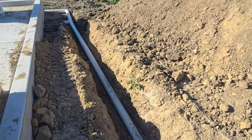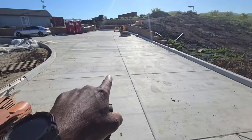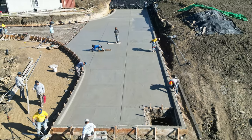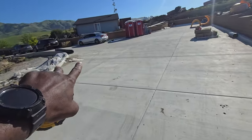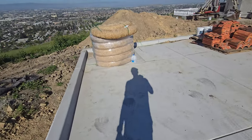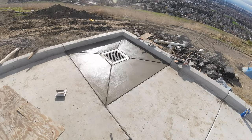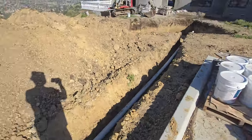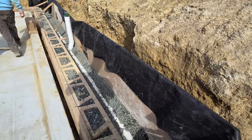These are all SDR 35s. There's a catch basin here — remember the 100-yard pour we did? I'll leave a link below; it's about five or six parts. Pretty much all the water from the back of that wall comes this way and feeds into this catch basin, overflows, comes out, and goes to the biodetention. We also have the retaining wall drain pipe here.